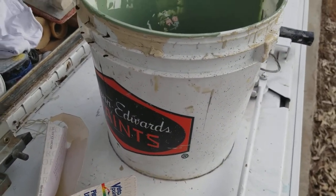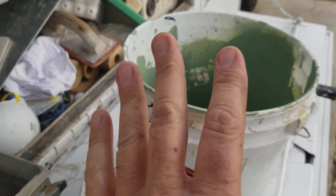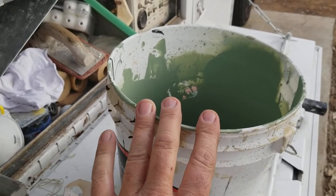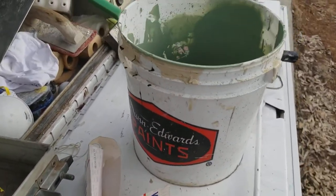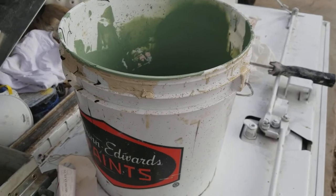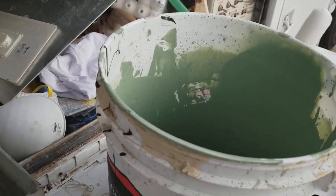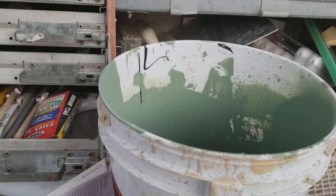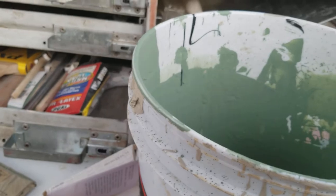People think they're going to be faster with a weenie roller. That's the thing not to do if you don't need to cut in a 12-inch cut — if your roll guy knows what he's doing and doesn't hit the ceiling. But I'm going to tell you when you can use a weenie roller or Slim Jim roller to cut in. Let's say you're doing T-bar ceilings or a ceiling where it's the same color over the same color — exactly, really really close, maybe just very slightly different, but so close that it can work.